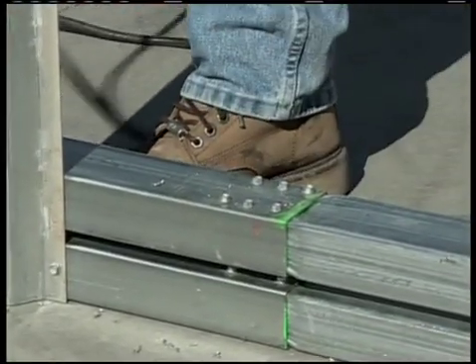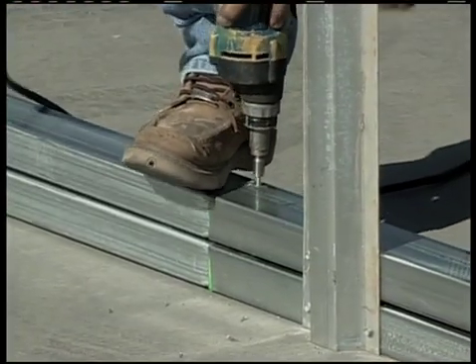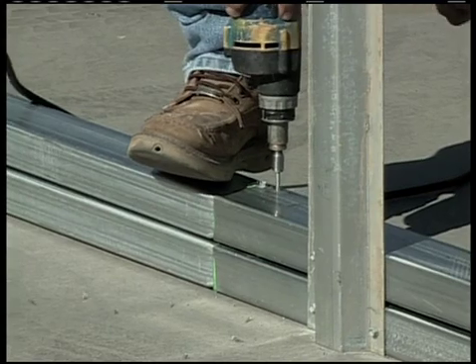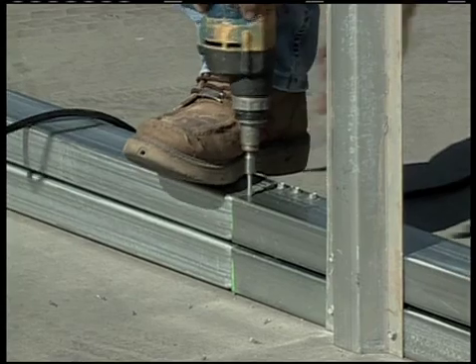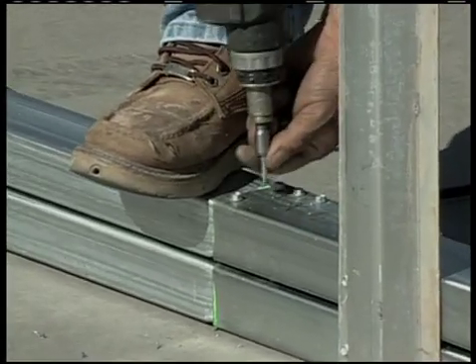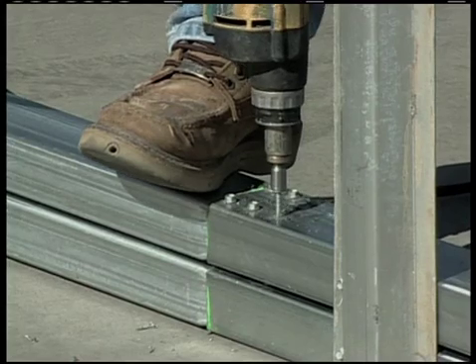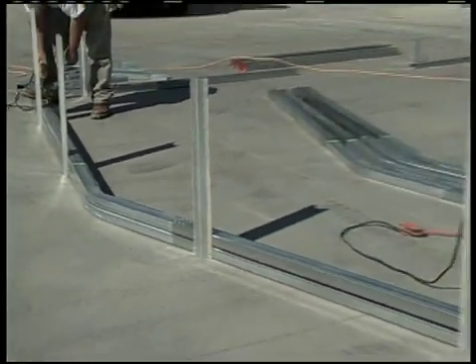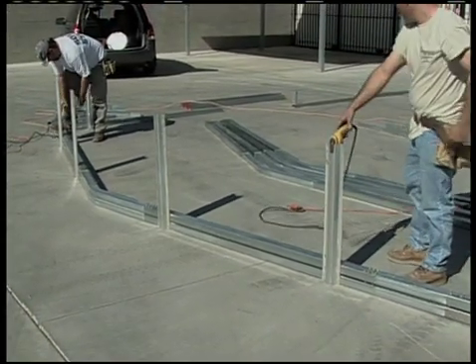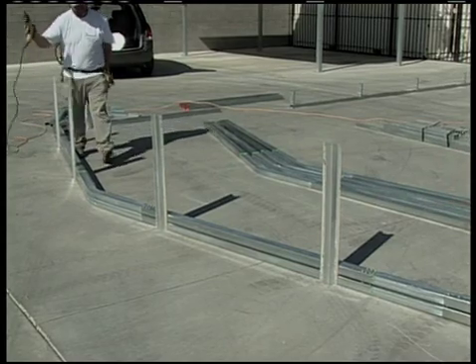The six screws are only needed on one side of the assembly. Just line up the joints and the seams so that it's kind of like a machine built — all the joints perfectly lined up. We're going to put truss braces on the second one. The first one and the last one on the stack will not have truss bracing, as those are the end walls and have vertical supports in them. Now that we've got the second one made, let's put the truss bracing on it.